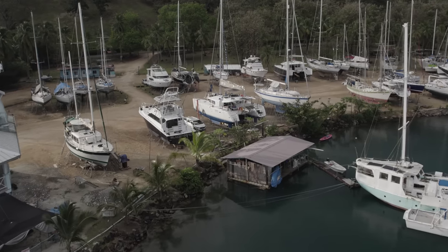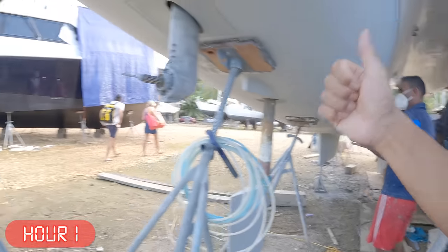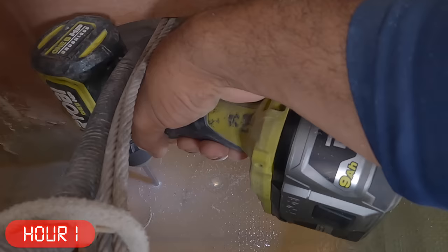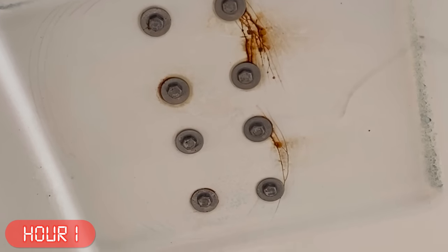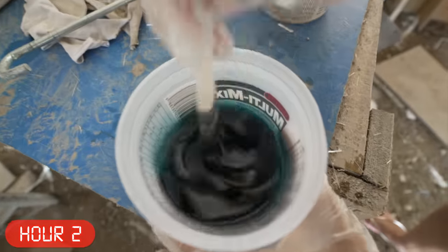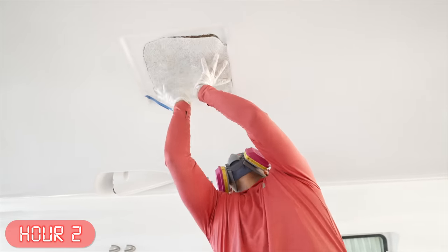Alexi is a painter, so his job was prepping the hulls. Mary and I started working on the steering pulleys. I thought we only had eight bolts to mount and totally forgot we still had to glass the bottom of this boat. I had already ground away all the cracks, but the bolts had pulled into the fiberglass. We used polyester resin here because you cannot use epoxy anywhere you plan to paint with gel coat — gel coat will not stick to epoxy.